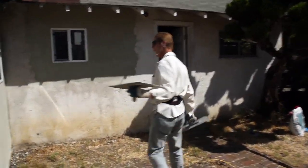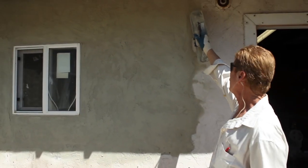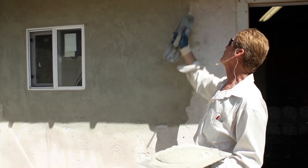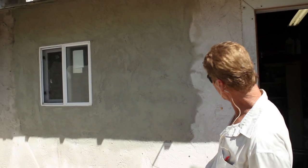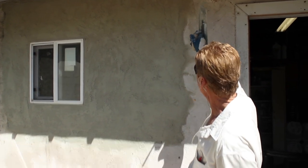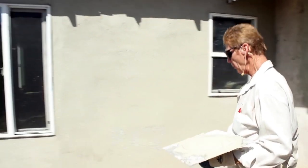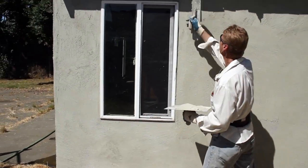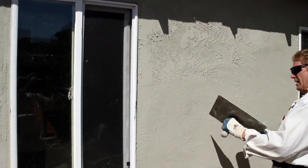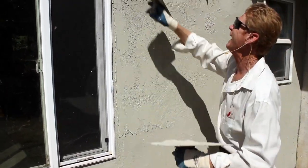This is what we were doing while allowing that coat to dry. This side was actually much deeper, much worse - so we went ahead and feathered that in. Can you see the outline of that patch because of the color differential? You should be able to. But the fact that this was indented a half inch shouldn't show now. What we do next is the simple part, which is the texture. I'm going to do the same over there, but I'm not going to show that side because we are burning daylight, guys.